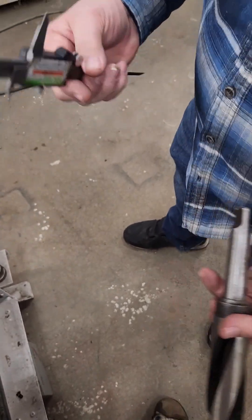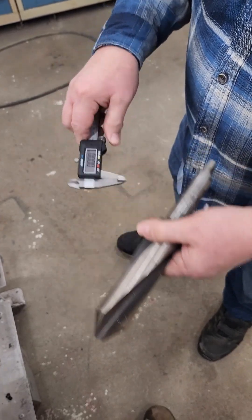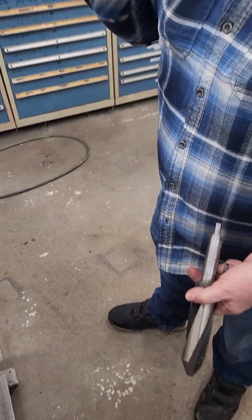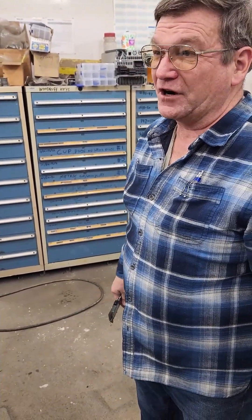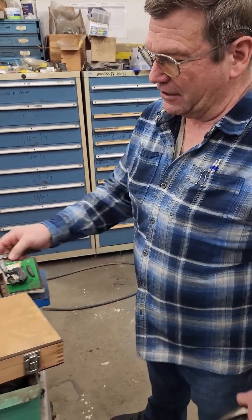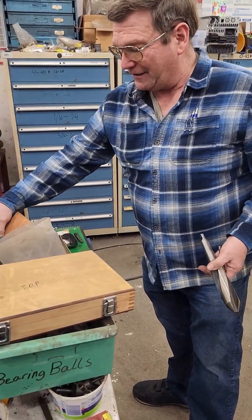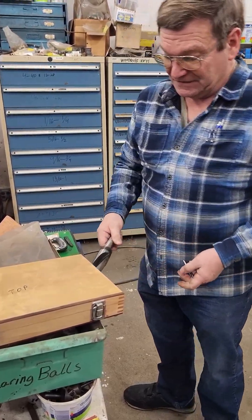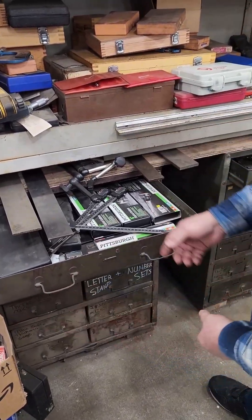The distance from here to here is also equal, so you can come up against it on that part and get a real nice measurement. They call these a four-way caliper — that came about mostly in the 80s. I think it was there in the late 70s, but by the time the 90s hit, even the cheapest of these had the four-way measuring option. Mitutoyo was the first one I remember having that.